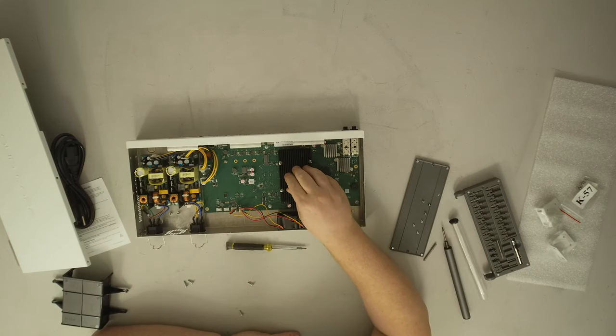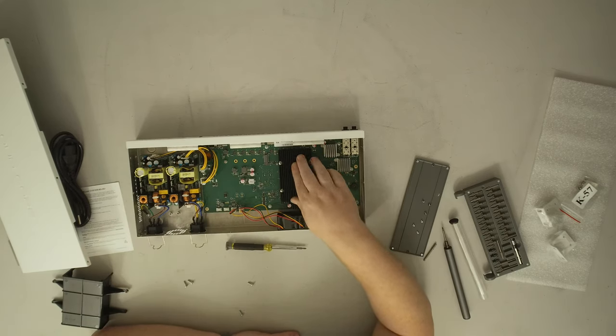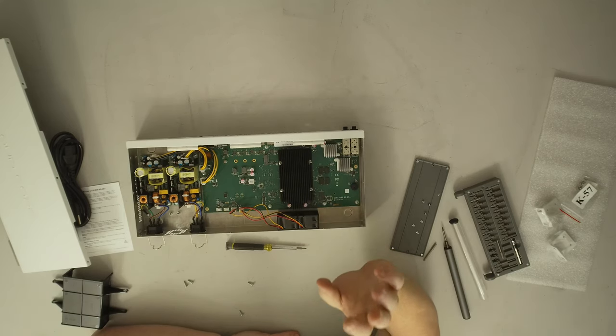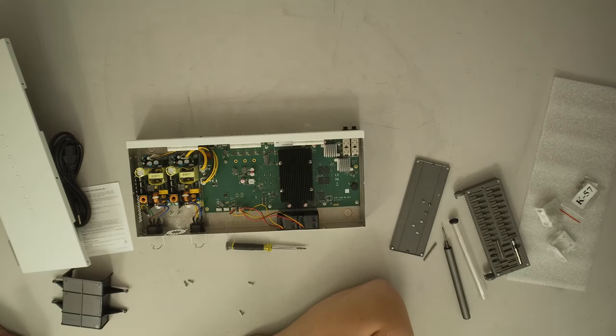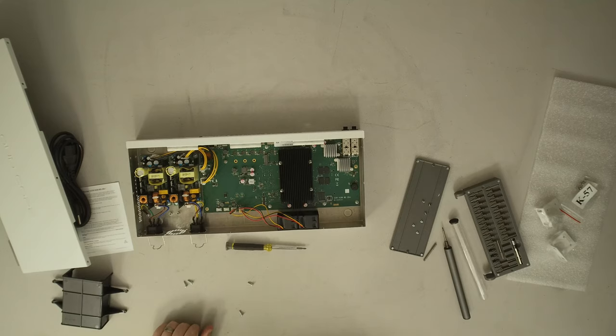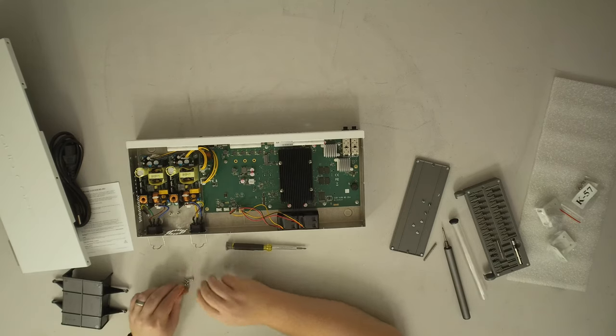And then, like I said, underneath this heatsink, there's a 36-core tile CPU. They use the same tile family as CPUs in their entire CCR stack currently, with the exception of the new 2000 series units. So you very quickly know that a CCR 1009 has a 9-core CPU, a 1016 is a 16, this is a 36, and then the very top end, they have a 1072, which is a completely 10 gig unit that you're supposed to be able to pass 80 gigs of traffic through. This particular unit, I believe, is rated for 26 gigs simultaneously, with a reasonable amount of rules and restrictions on it.